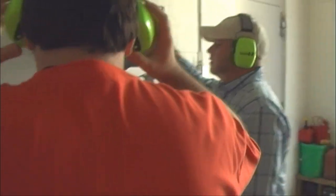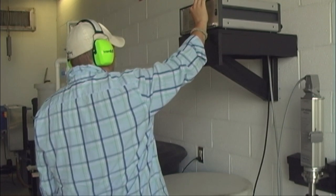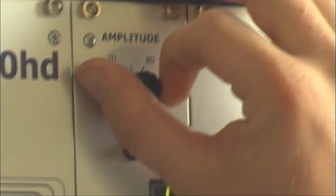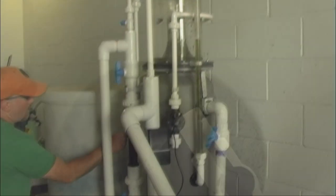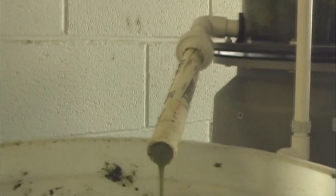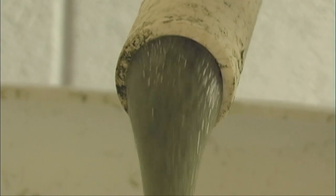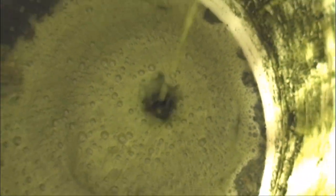One of the primary challenges of using algae for fuel is oil extraction. Brunswick Community College has developed a unique mechanical separation process. High-frequency ultrasound is used to burst the algal cells and release the oil contained within them. The sonicated culture is then run through a foam fractionator, also known as a protein skimmer. The foam adheres to the lipids and other biological molecules, separating them from the remaining cellular biomass. The oil attaches itself to the foam, and the foam is partitioned off from the rest of the materials.